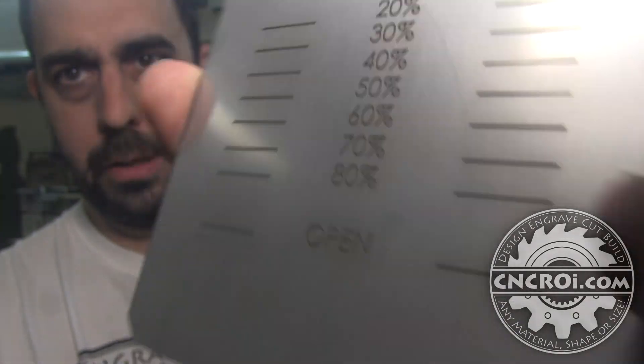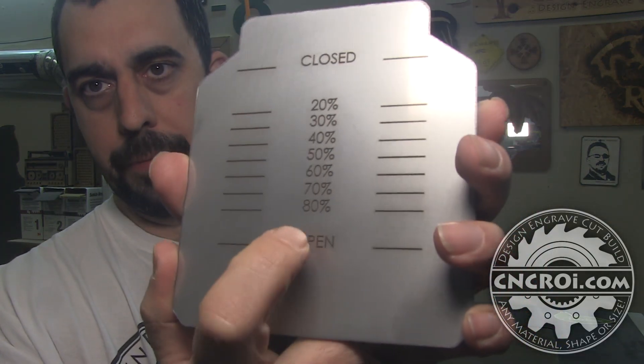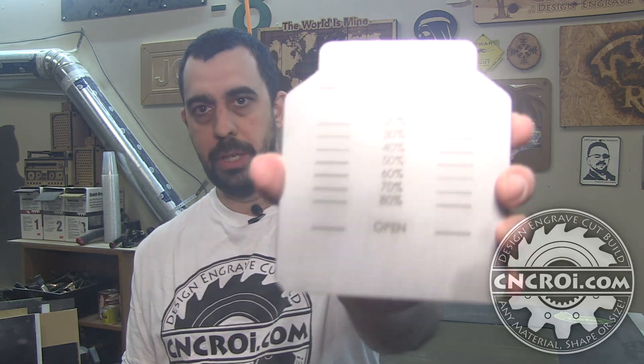After a quick clean-up you can see it here. The customer got this done in stainless steel and what they're going to do afterwards is paint it. The goal is that when they put paint on, you can still see what we etched. There are two advantages: you're protecting the surface during application and making it more visually interesting with color instead of just the plain stainless steel look. But also, even when the paint comes off — which it will — you still see the markings, which is very important. That's why deep etching makes sense for this customer.